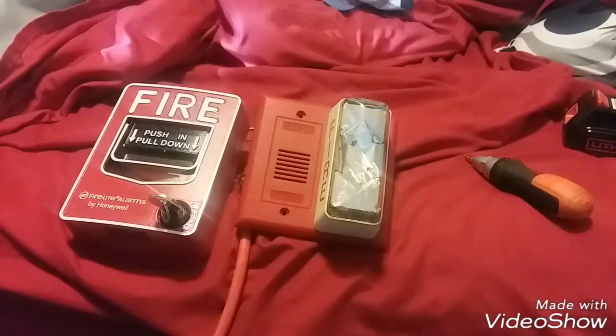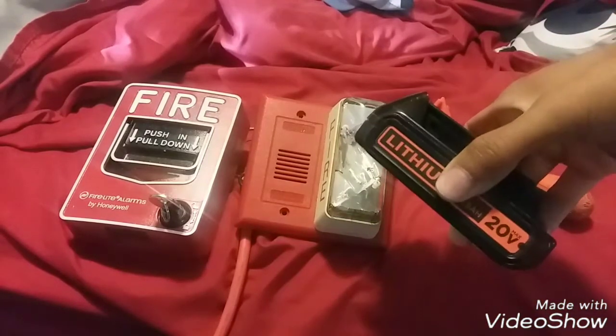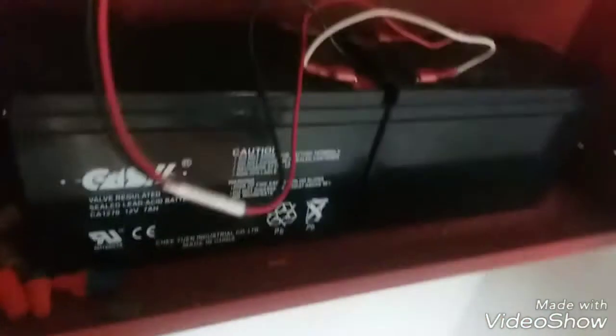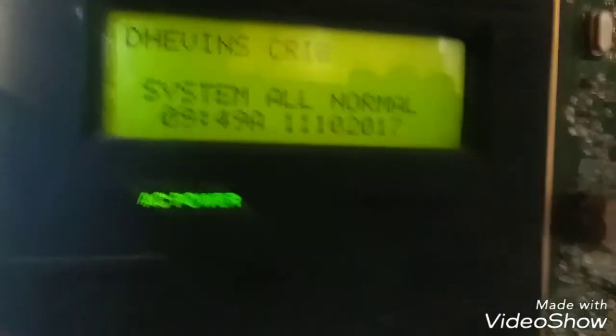You can wire it to three 9-volt batteries, or a lithium 20-volt battery, or two 12-volt batteries. For 12-volt batteries — as you can see this is in my MS5 — you need a wire to jump from positive to negative from one battery to the other. That's negative, that's positive. You jump this and put the circuit on negative and positive. That's how you wire a fire alarm to a pull station. Hope this helps — I'm Black Lightning, peace out.